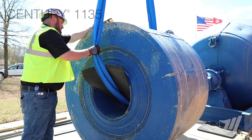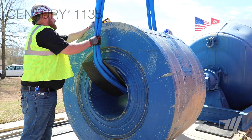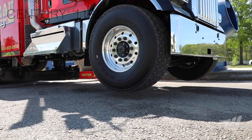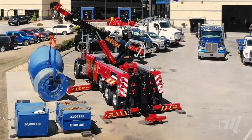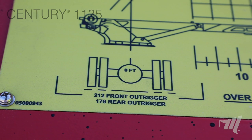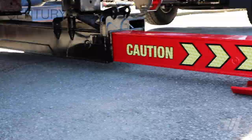When you're lifting, you're going to want the entire truck off the ground, wheels suspended, because the chassis is used as the counterweight. If you're going to be doing a truck that was stuck out in the middle of the mud, you'd leave the tires on the ground for resistance. But since we're lifting and rotating around, you definitely want the whole truck off the ground. Standard on the 1135 is the 212 inch wide, two-stage front legs, and in the rear you have the standard 176 inch, three-stage rear legs. As you can see, we do have the rear legs cribbed here.